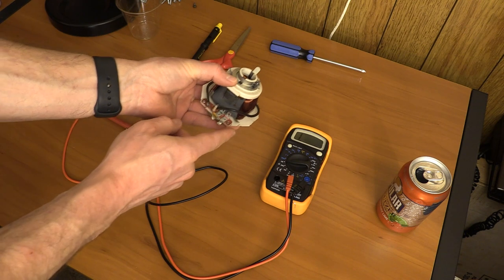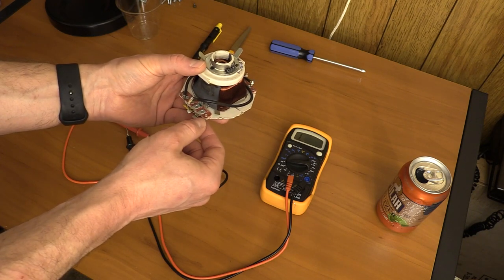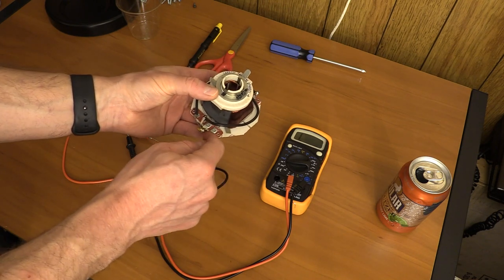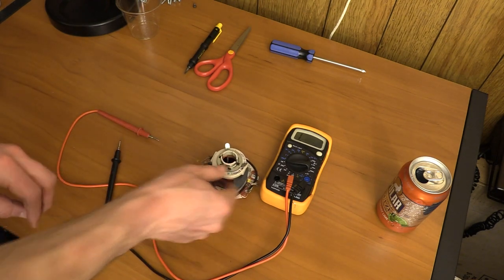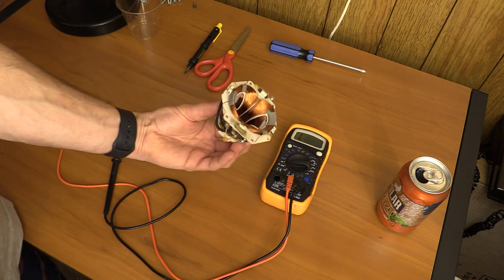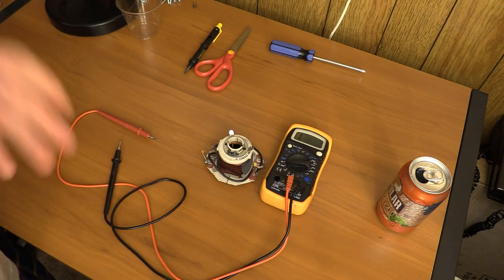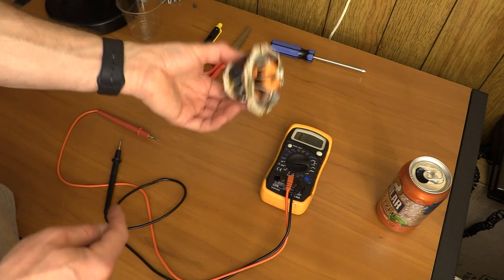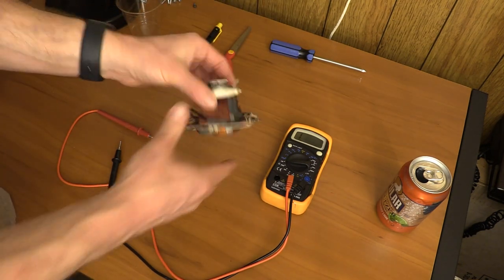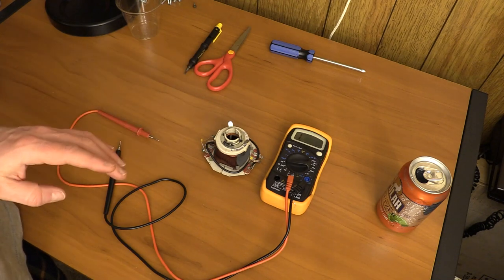So what we're going to do is I'm going to try and strip this a bit. I've got to be careful not to mess up the winding, but I'm going to try and strip this and put a blob of solder on it and try and solder it right to the edge here — see if I can get it to go. Hopefully that'll be enough to connect it, and then we'll put it back in the Model 3 and see if it works. I'm really glad I took the lid from the working Model 4 and tried that out, which verified the computer was functioning and also gave me an opportunity to test the video driver board. That ruled out any issues getting horizontal into the inputs. It turns out the coil is bad — so we're going to fix this coil and see if the Model 3 works.